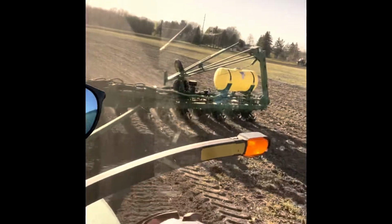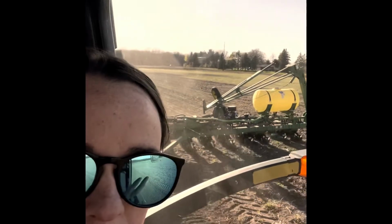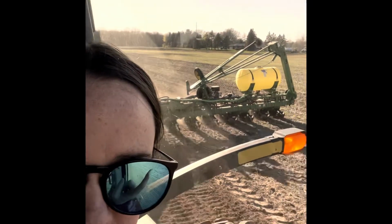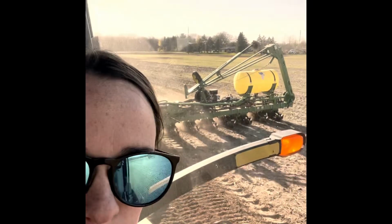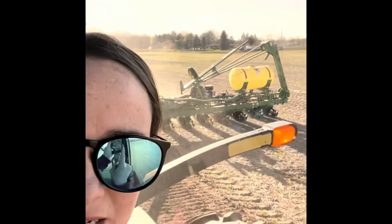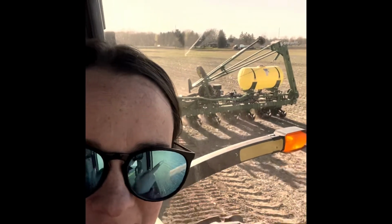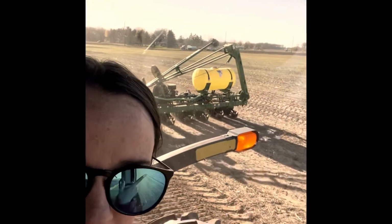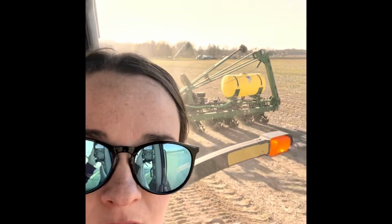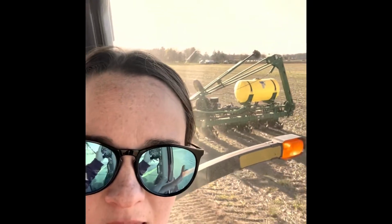And I want to point out something. This is a marker. This is a little arm that comes out outside the planter, and it marks where the tractor should be at midline when he goes for another row. That's what they used before GPS, and they still use it now if they have a shorter, narrow space, because it's not time saving to use the GPS, but it's time saving to use that marker. We just used that marker, and unfortunately I didn't get a video of it, but he extended the arm straight out and made a mark in the field so that when he comes around again, he'll know where to line the middle of his tractor up so that he can have evenly distributed planting rows and not waste any ground.